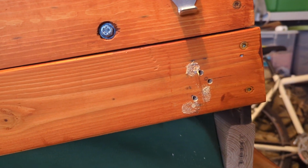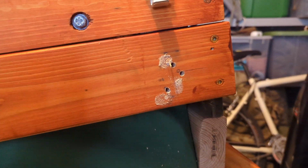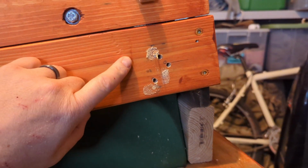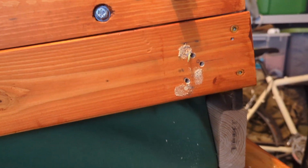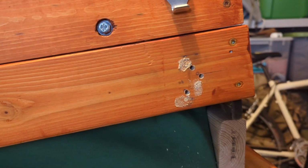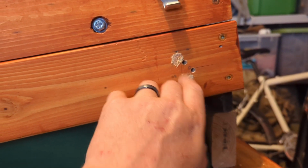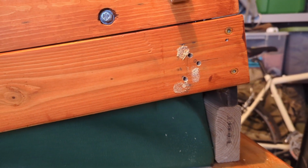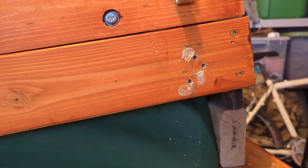I'm going to take a quick second to give a shout out to a buddy of mine that showed me this trick. It's Rob Winter out at Liberty Timbers. You can check him out on Facebook. He's a veteran and does a lot of awesome woodwork. He just moved to Texas recently, so I know he's not as involved with the woodwork, but he's getting his business put back together. Anywho, this is toothpicks and wood glue. It fills the hole, because I got these holes really close to each other. So it'll reinforce that old hole, fill it up, and make it solid. And then I can use that bolt, because I'm worried about that bolt pushing through and going into that other hole, breaking. So it's a quick little fix. I'll fix up where I started to drill those other holes, but it gets us back on track, and no one's going to be any wiser.